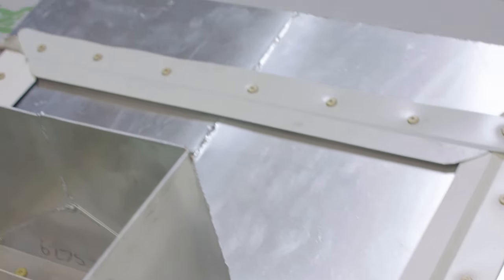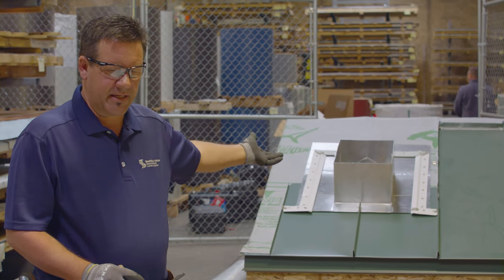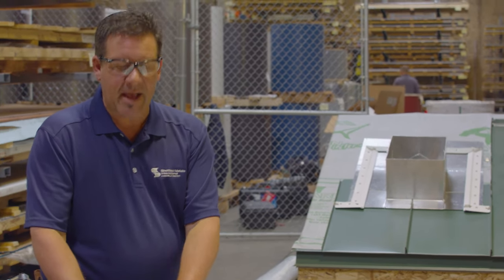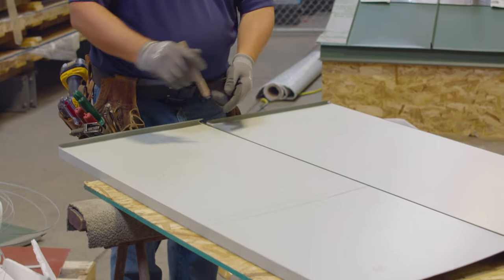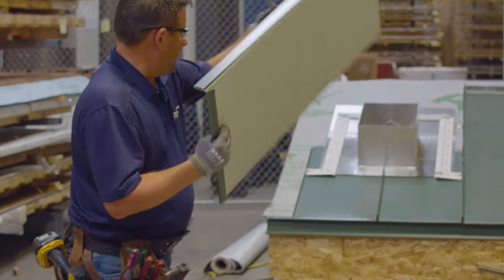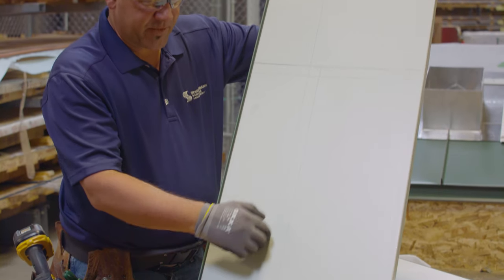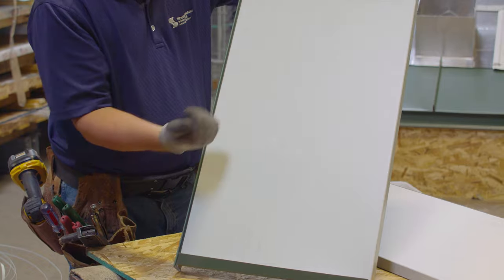Dave's installed the offset cleat. I've taken the measurements off the offset cleat and now I'm going to mark out the panel for the hems. I always recommend doing it on the back side of the panel — a lot of people do it on the front, which is a little tricky because it's reversed, but you get a cleaner surface to work with. This is the right side panel. I've marked where the edge of the panel is going to rest, the visible portion, and where the one inch that will fold over creates our open hem and hooks onto the offset cleat.